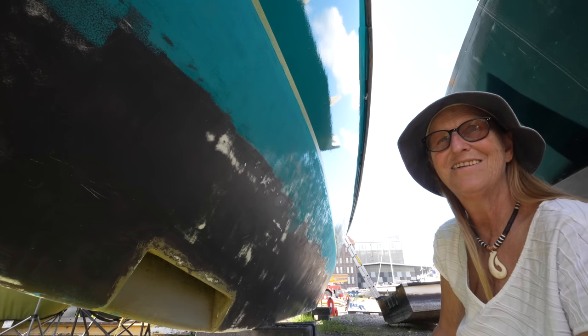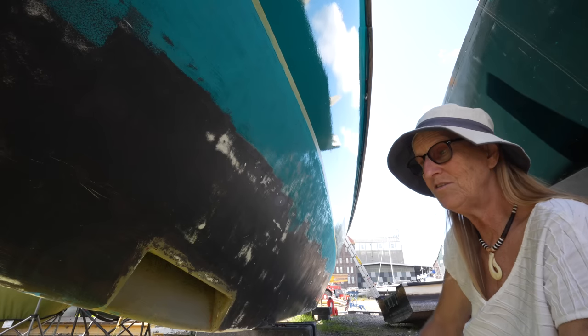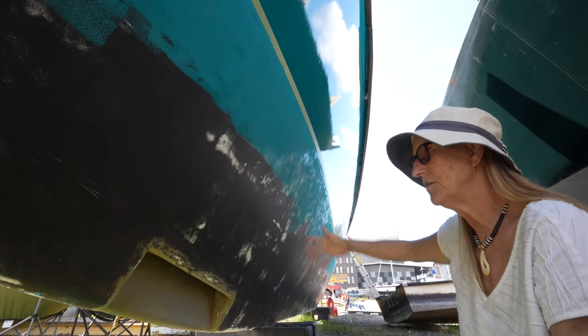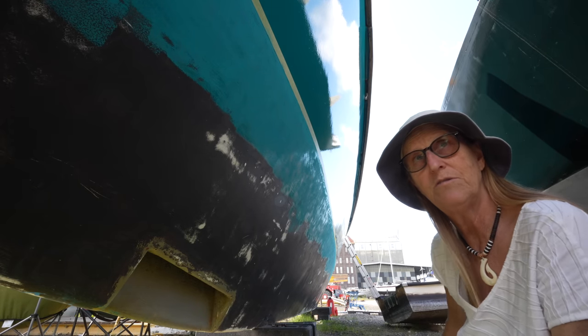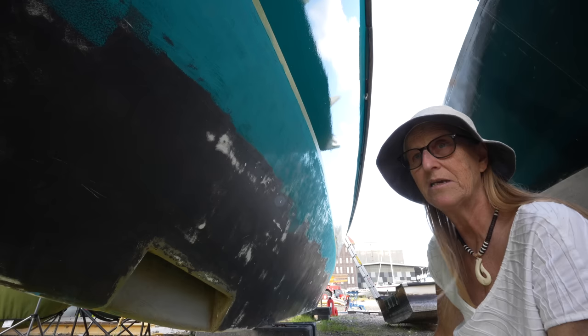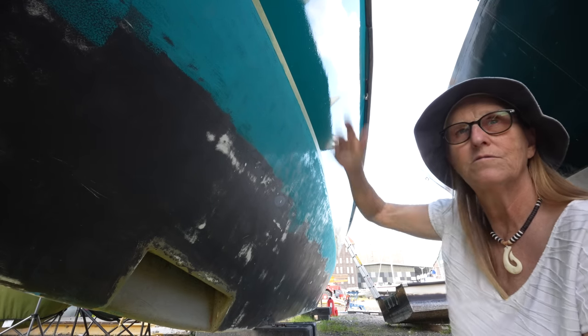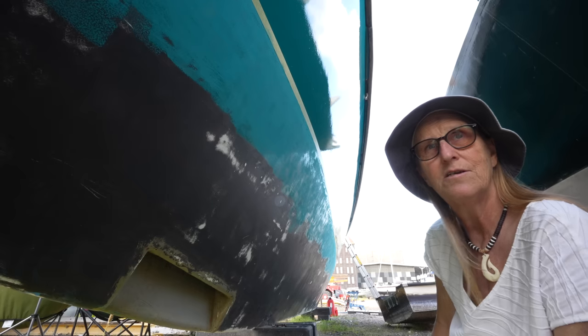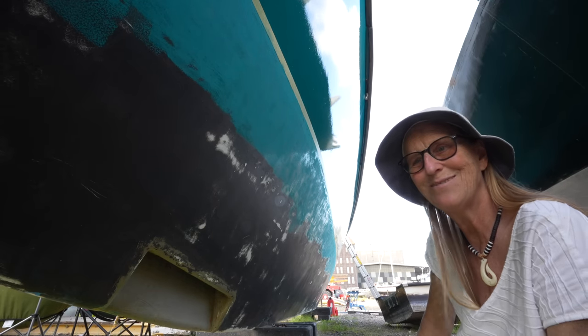And the action of the boat sideways to the waves, is it? Well, it's all right. It'll just lift one hull and then the other hull. They've been in very big waves sideways. It's Gaia. It went through really severe gales, big waves sideways. They smack into the hulls a bit, but because you don't have a lot of freeboard and you've got flow-through decks, that water can go up and just comes out.